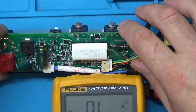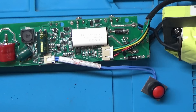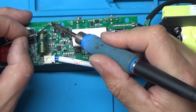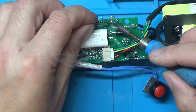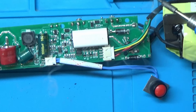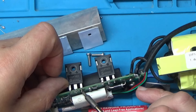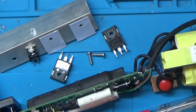Right, I'm going to unsolder these and then we'll see if we can get a bit better view. I'm just going to put a bit of leaded solder on first and get the meter out of the way. So I wonder what's caused these to fail - it's not usage because it looks like literally a brand new product. So I wonder if there's some other fault further back that's caused the problem, or if there's something wrong with this transformer that's caused it to blow the transistors or MOSFETs.